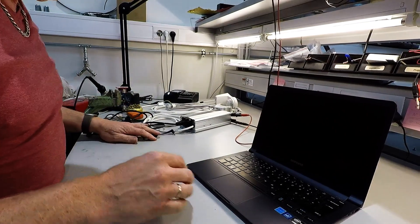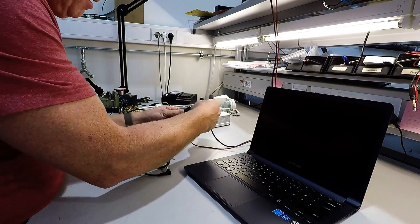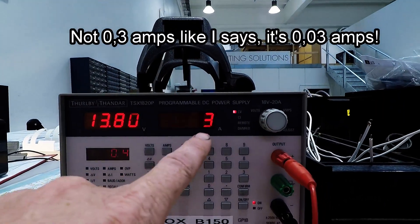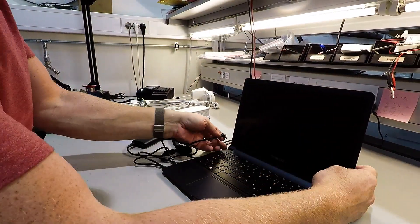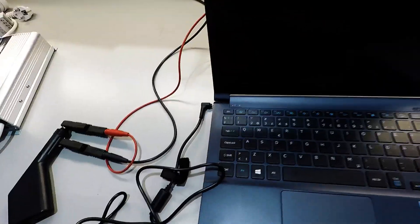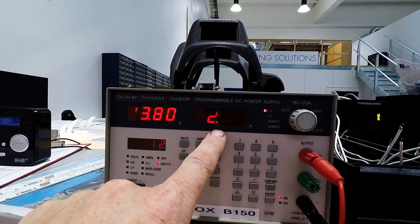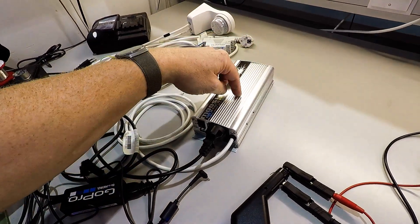Let's remove this and test this one. First of all, 0.3 amps when you have only this one. And let's put it in the computer. Here we go — LED is charging, and now 2.25 amps. That's a whole amp lower than this one, because this one draws almost one amp all by itself.